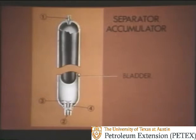The bottle is pre-charged with nitrogen through a valve at the top. A port allows hydraulic fluid to be pumped in and out of the bottle. A poppet valve closes the port when the bladder pushes against it. An O-ring integral safety relief will relieve pressure below the 12,000 PSI burst pressure of the vessel.